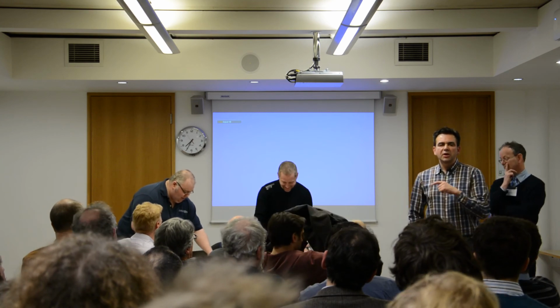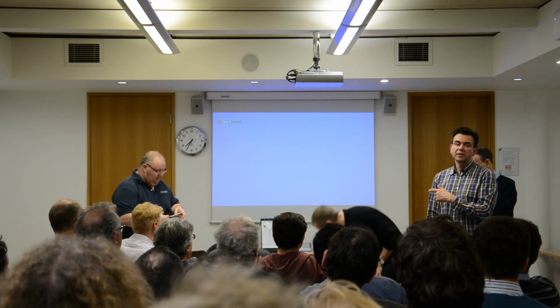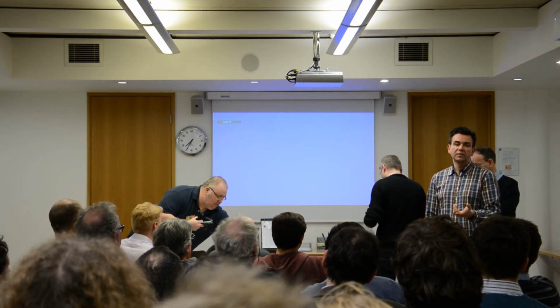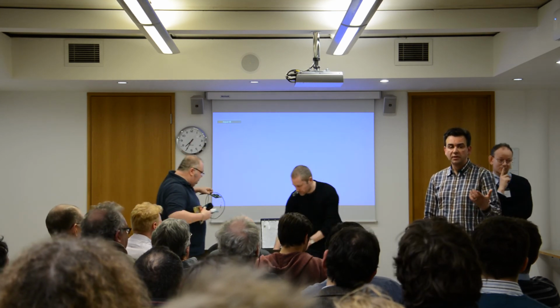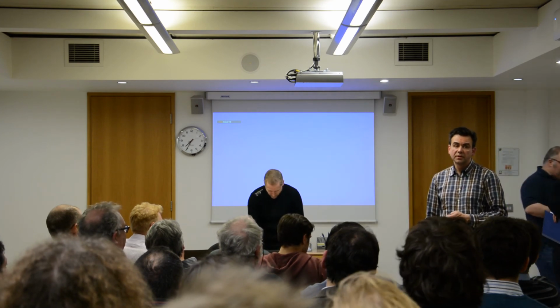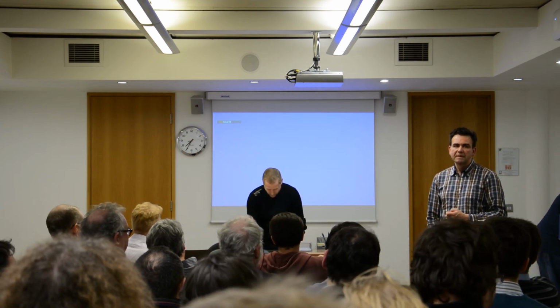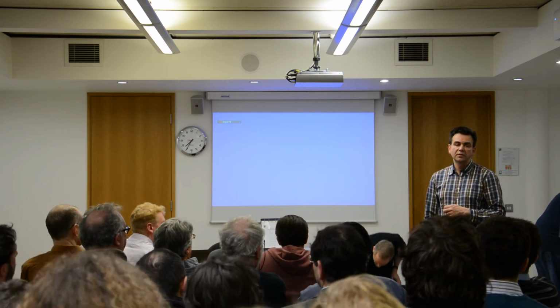Okay, this particular device is low frequency only, but when we move to the high frequency version, then you would be able to implement in software some of the Mifare attacks. So you'd be able to do a darkside attack, or one of the ones that actually recovers the key through parity errors on challenges. There's a high frequency version. As soon as we get this one out, we're going to start work on the high frequency version.